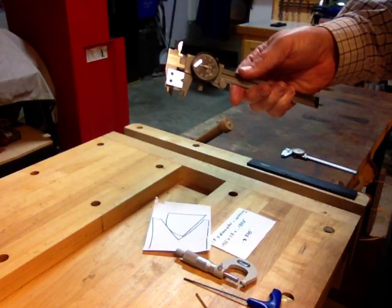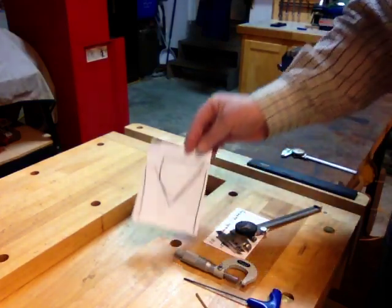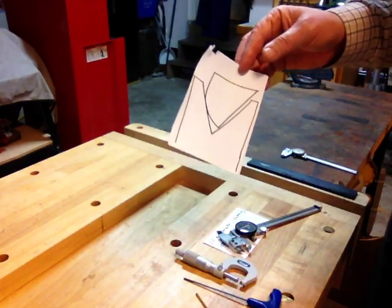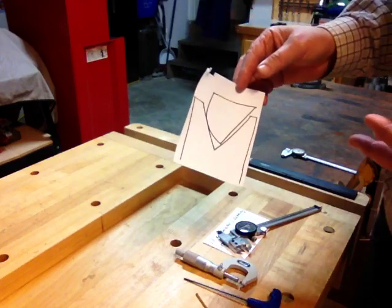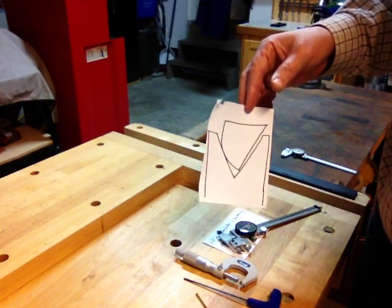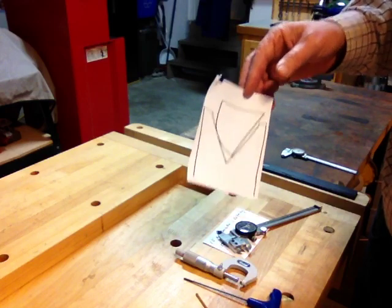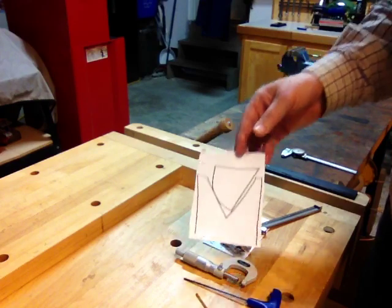I think Bill was a very innovative guy — he built a lot of tooling for bamboo rod making. Just be aware that sometimes the value on your micrometer may be under-reading a little bit. It doesn't matter what you use as long as you measure everything and write it all down. Then once you have the glue off and a clean rod section, measure everything again and find out where you are. Learn to hit the numbers. Hope you're at the shop building and we'll talk to you soon.